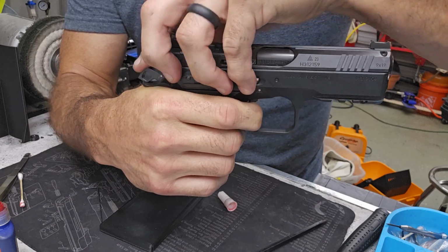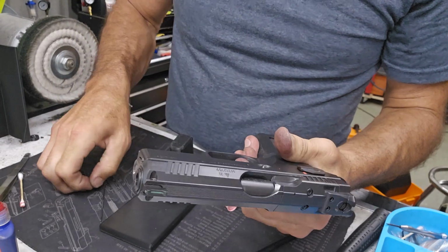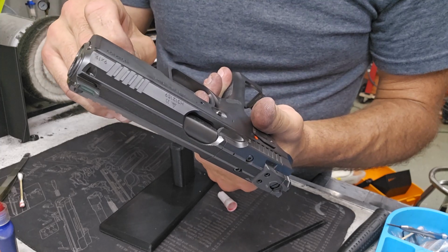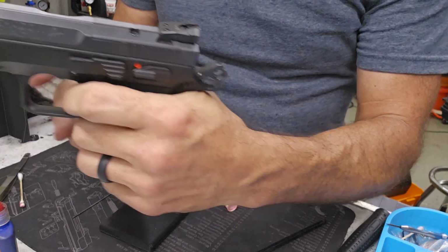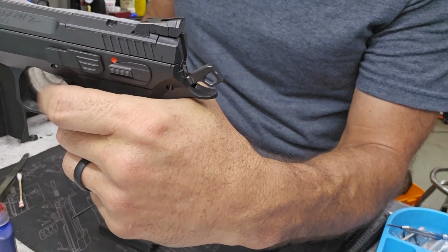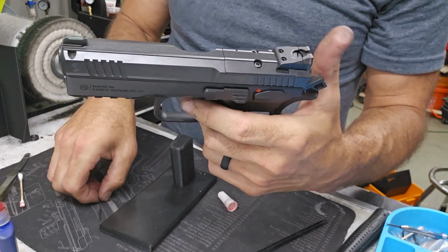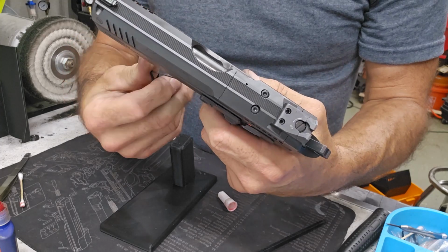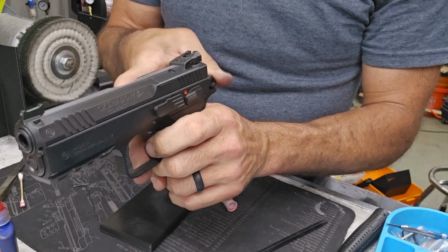It should not be dragging anything. So that's fine, it's not dragging, great. That means I can take a little bit more. I can get my post travel set screw in a little bit more. I'll go half a turn by half a turn. See, it's dragging, even half a turn was too much. It's cocked and it won't work, right? So I need to take that off. So I'm gonna pull and get a quarter turn back. See if it's dragging. Perfect, it's not dragging.